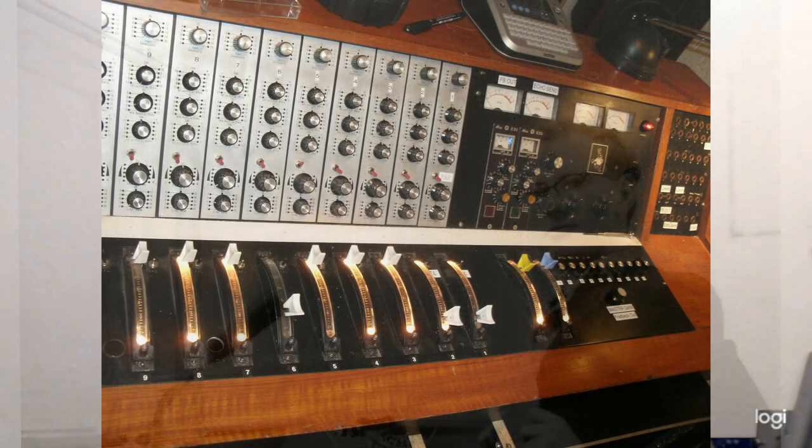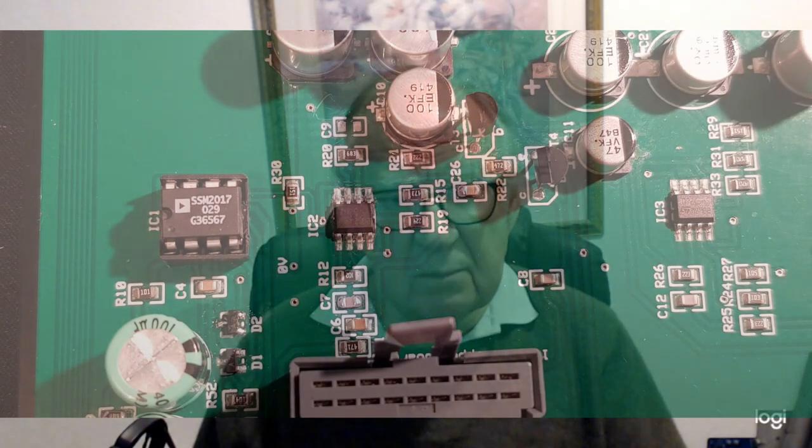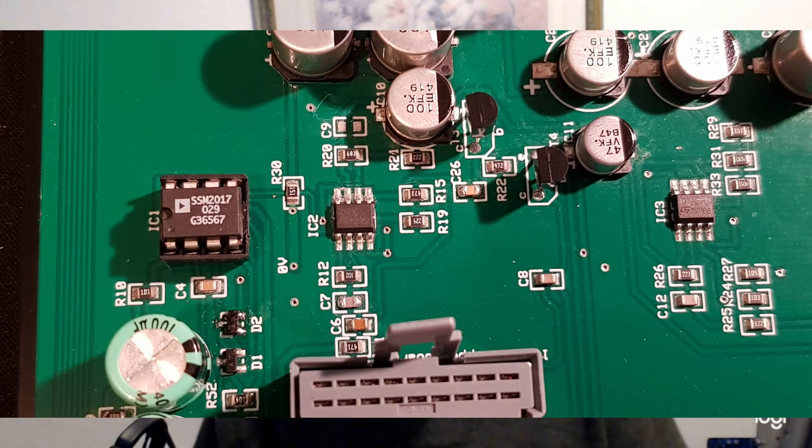When I started to design and build equipment in the 1960s, we were struggling with understanding how to get the best matching from a microphone to a valve amplifier. Then, once transistors were invented, how to achieve minimum noise without the amplifier sounding like a cheese grater? In the 1980s, integrated circuit designers came up with designs that gave us good matching from microphones combined with minimum noise and distortion. The integrated circuit type was the SSM2017. Nowadays there are many similar chips — they all claim to be more suitable or superior in some way, but basically they're all the same.